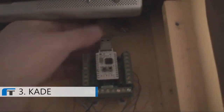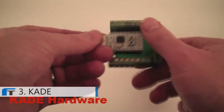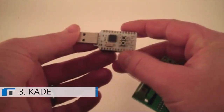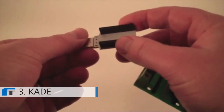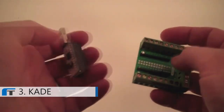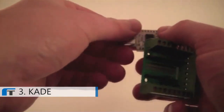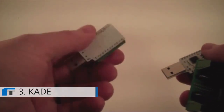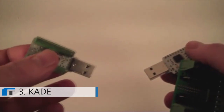There's the Cade. The wiring from the arcade joysticks and buttons connects to the screw terminals. This is a fully functional prototype of the Cade hardware and it has two major components: a small USB programmable microcontroller, and the Cade software running on a couple of different boards. We've settled on one for our initial run and we're really happy with the price and performance on it. We experimented with using really small terminals directly on the AVR, but found that you had to use tiny screwdrivers and they were really hard to get in and out to program.